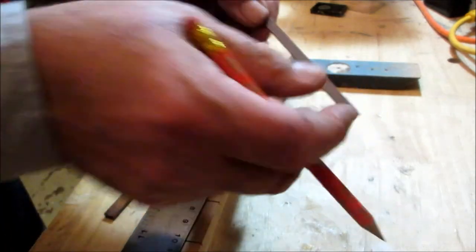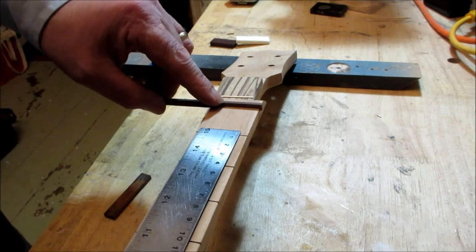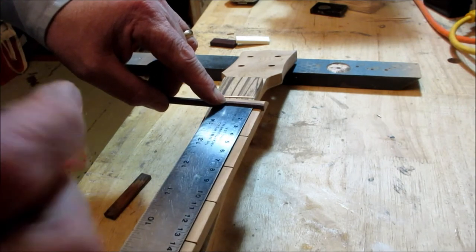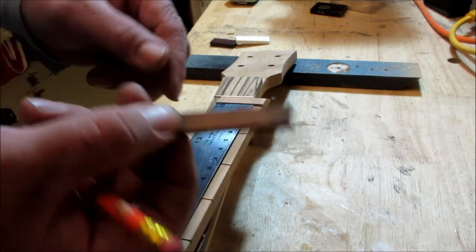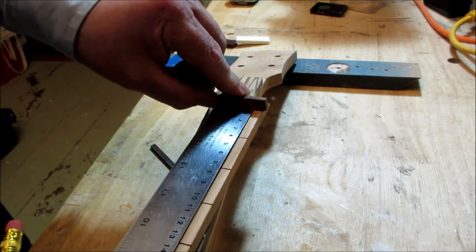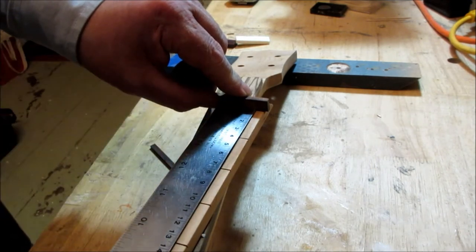So I would need to use something a little bit taller. I'm going to make sure it's flush over here, cut right outside of that line — gives me room to sand — and then use this again to figure out how much I have to cut or how tall my piece of wood might be. You might actually start off with something more like this that's taller, that would fit down in there. You lay this here the same as the other one.